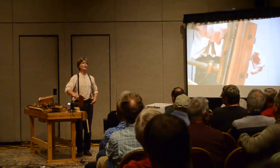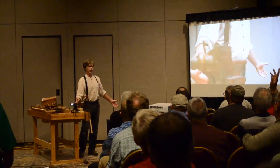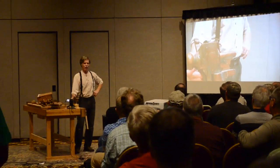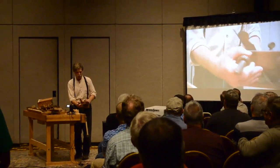You must have seen that and pointed it out. Look at this though - how do we improve that? Probably put a spacer in there. A spacer if you wanted to, yeah. But nobody ever had it, so it didn't evolve that way - nobody put spacers in there. You change the irons, tap them out with the wedge, tap them in, adjust the depth of cut by tapping it up and down, adjusting the wedge.